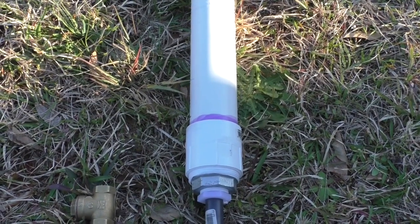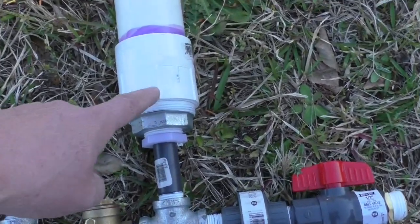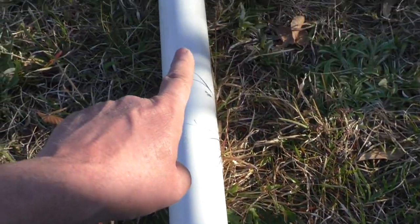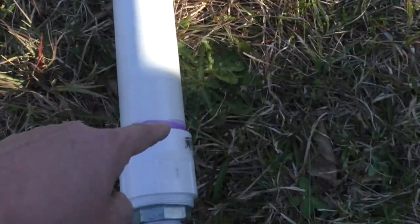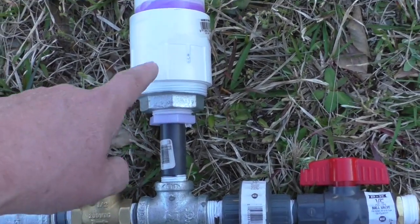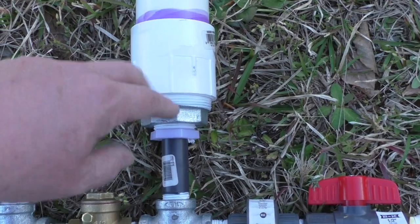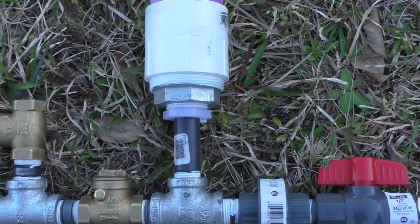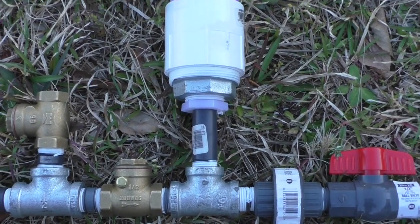It will still eventually get waterlogged, so you'll notice I put the water valve down here on the screw end, not the cap end up there. That way I can come back and unscrew this every couple of months, drain any water that's in there out, refill that tube with a little bit of air, and it won't be waterlogged any longer.